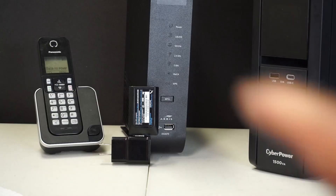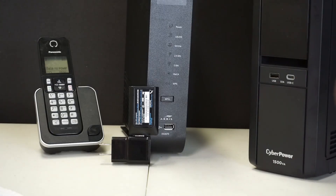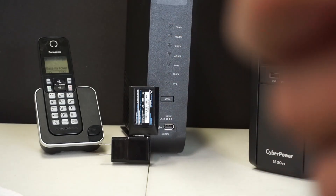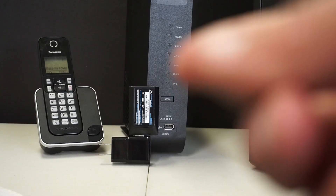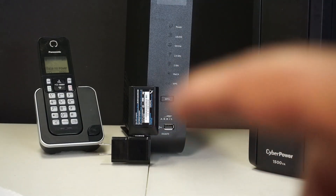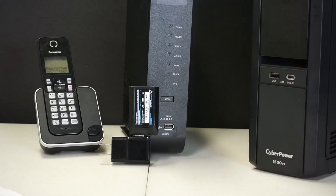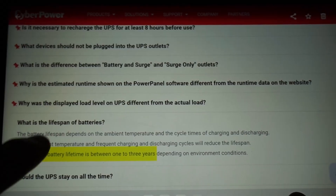Can't trust anybody! Now, does it matter much? Not with these devices — they don't miss a beat. But if you had sensitive equipment like medical devices or critical data systems where you couldn't tolerate these interruptions, units with constant backup power and no switching are available — but now you're talking quite a bit of money. For residential use, this does the trick, but it's not 4 milliseconds.